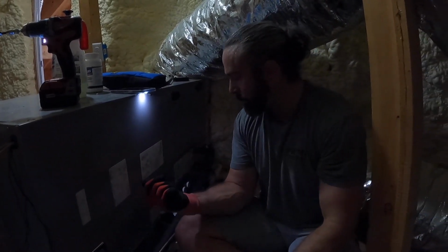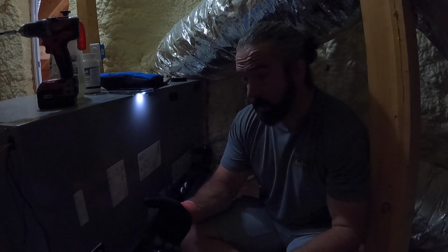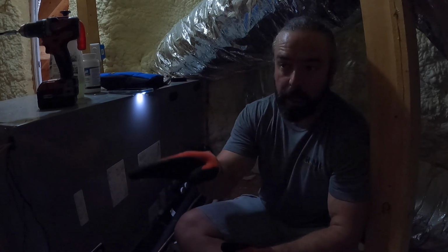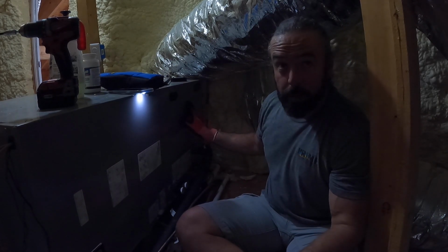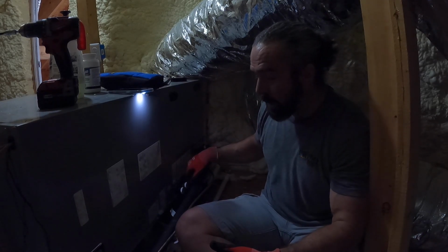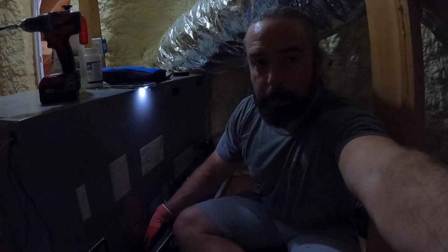So had this indoor unit not had these float switches, that would be a recommendation we would make to the homeowner on the necessity for that. This drain pan that's in here, and then this drain line, is typically run on a slope. It's supposed to be run on a slope to the outdoor unit or somewhere outside where the condensate that this unit is removing, or the humidity that it's removing from the house that then turns into condensate, drains out. If this drain ever gets clogged and you don't have the float switch in this drain, it saturates the entire bottom of the equipment, the insulation in there, and then it starts to seep out into this pan if you have one, this backup pan.